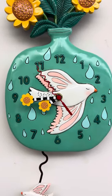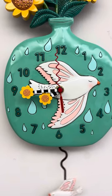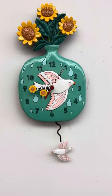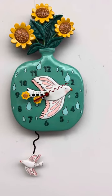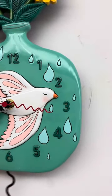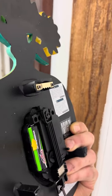The next thing is hanging it. You need to use a screw and a stud, a nail and a stud, or a very good hollow wall anchor. No picture frame hangers, and I would not suggest putting it just directly into the sheetrock just for stability reasons. This is a cast resin, so if it falls off the wall it can actually shatter and you don't want that to happen. When you hang it on the wall you can see kind of how far out the screw is sticking — not very far, maybe a half inch — and if you look at the back of the clock there are two feet on the bottom and then the hanger at the top.